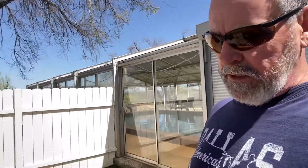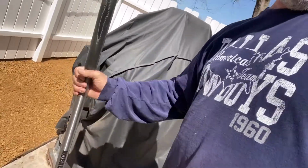Anyway, I'm getting ready to start tamping. You got to wet it down. Key here, do not wet too much. Don't wet it down too hard, because it'll start sticking to the bottom of your tamper, and then it starts making holes in your base. It's a pain in the butt because the aggregate will stick to your base. You can always wet it down after you tamp it to set it. Wet it down pretty good after you tamp it, and that way it will dry and set nice and firm, so you can then lay your grass.